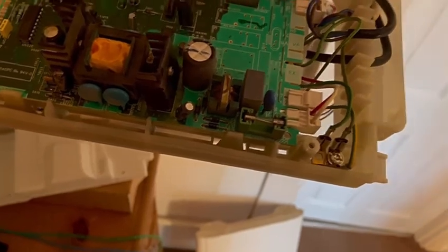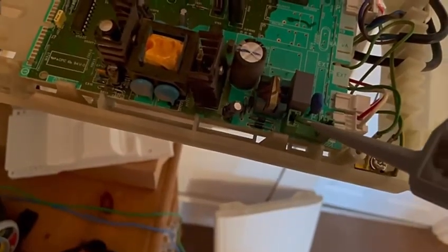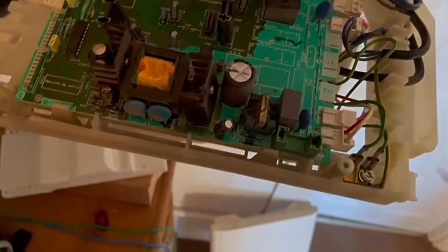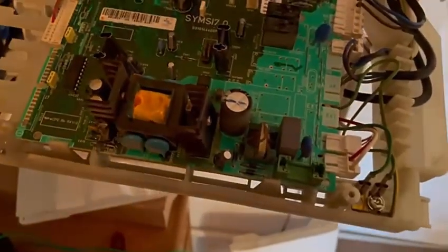I've tested the live and neutral here, and then the live and neutral coming out of there, which is all okay. If we trace these wires back - these two red and white wires - that brings us to here, and as you can see there is a fuse on that one. Looking at the fuse it all looks okay, but this is basically where I'm at. I've tested to see that live and neutral is present here, then probed onto the fuse and nothing came up. I disconnected the fuse, turned it back on, probed there and it's working. I'm not quite sure what it is - it might be completely irrelevant or it might be causing the problem. The fuse itself is absolutely fine.